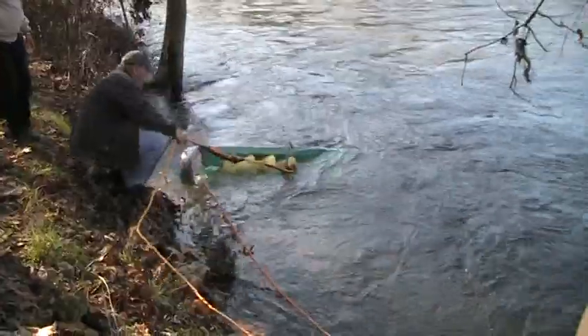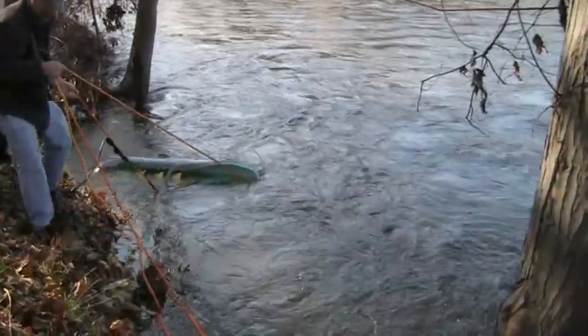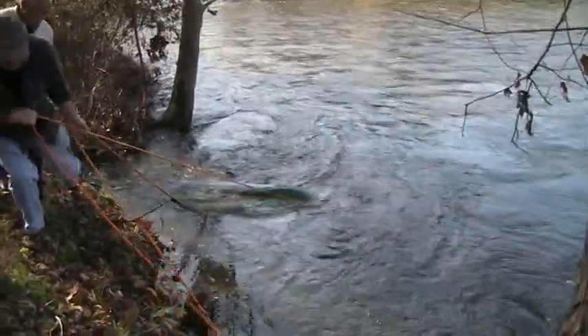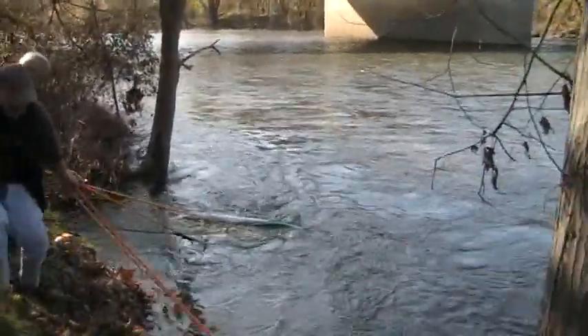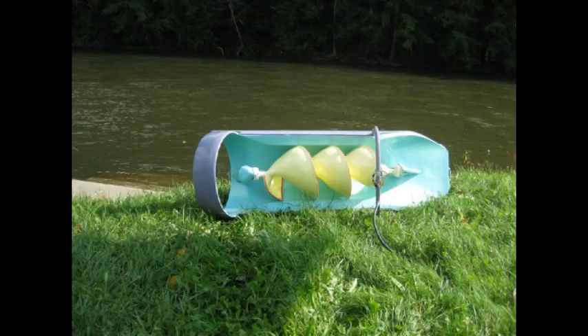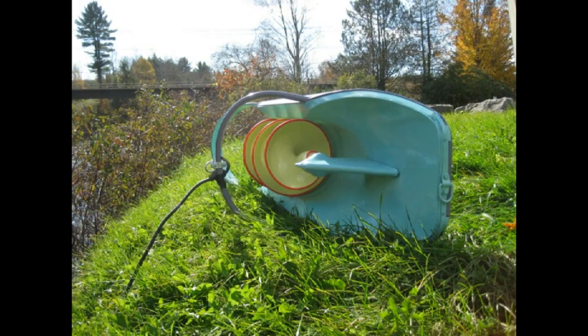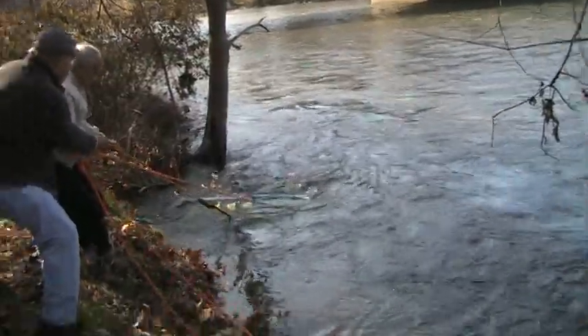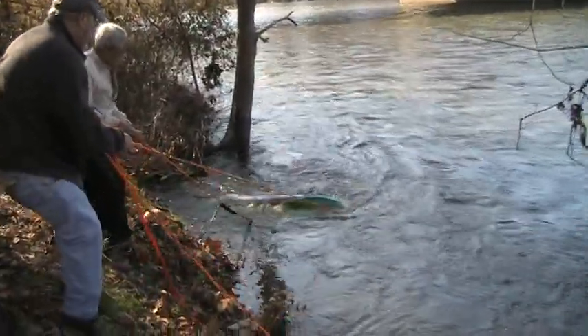The Sailing Shroud should displace a water weight of 85 to 95%. It consists of a half pipe with shielded brackets and bearings containing my Archimedean type rotor design. The half pipe provides a volute and channels the flow passing through the rotor. It rides in the water with the diameter of the cross section of the half pipe vertically positioned by means of flotation and ballast.